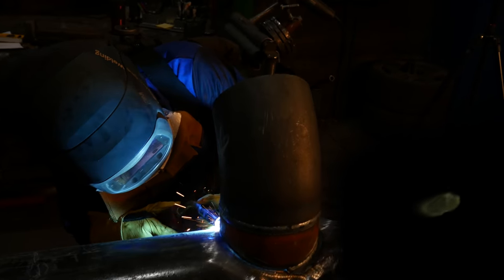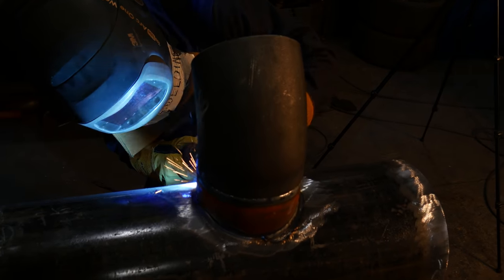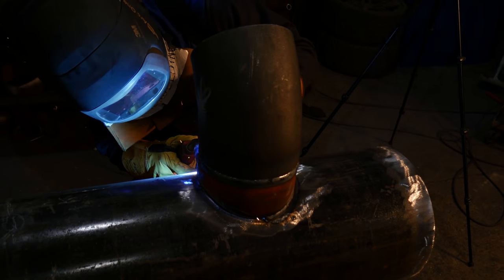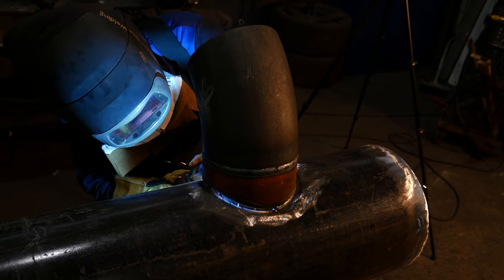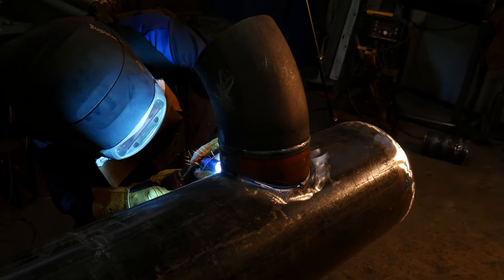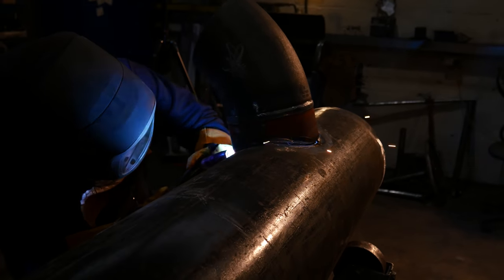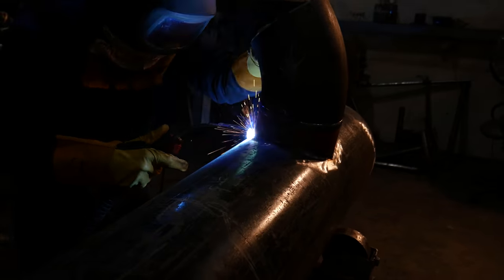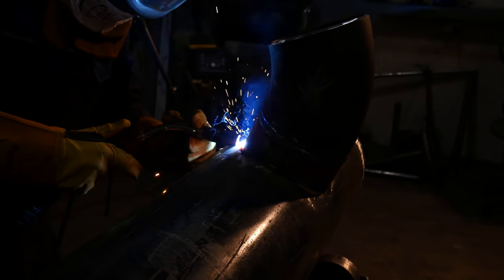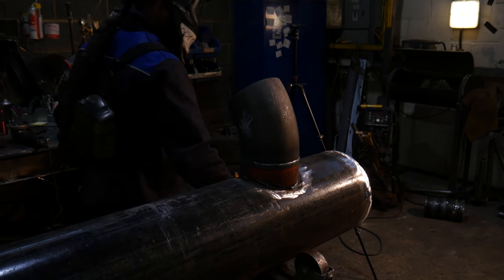I can see it blowing right through — that's what I'm looking for. This is only class two, so for every 100mm of weld you're able to miss 25mm of root penetration. I'm stoving it down a little bit now just so it's not too hot and it doesn't blow through. When I'm going over the tacks, I like to bring the pipe up just so gravity is on my side to help me get penetration in there.